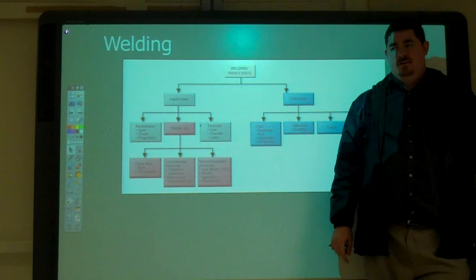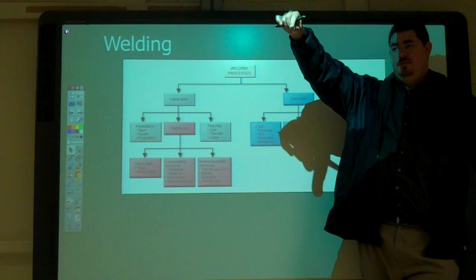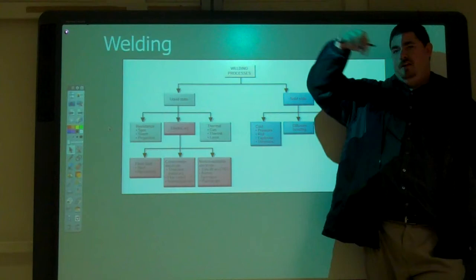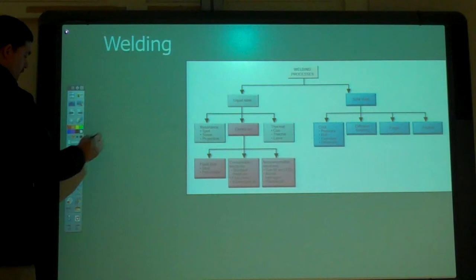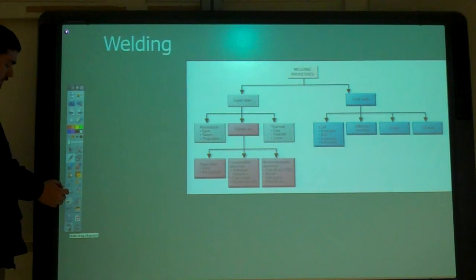It was used when they were making water heater tanks. That thing just rolled over and seamed. On the inside tank, they did a seam weld, when they rolled it up. On the outside tank, the one that was white, they just did a locked groove. So that wasn't a weld, that was a mechanical joint. You bonded those two seams together and then just smashed them together. So that's a mechanical joint. But on the inside tank, they did a seam weld. Okay.